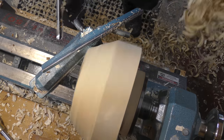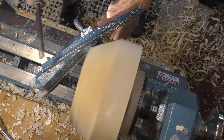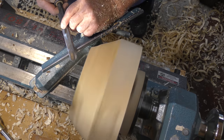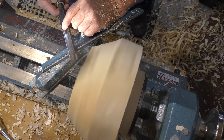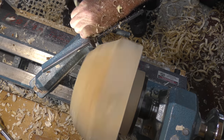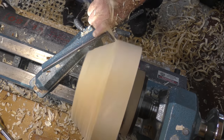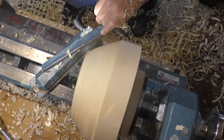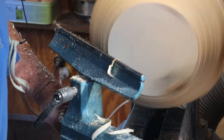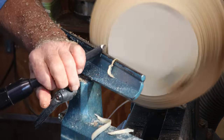You can see it takes it off pretty well. You can also do this with an old 1930s one inch spindle gouge with a fingernail grind — not quite as efficient but pretty good. This is a Thompson which I've also ground with an asymmetric grind.